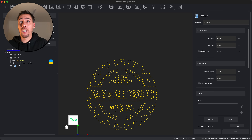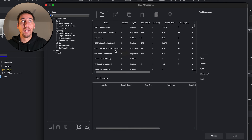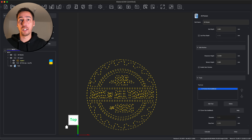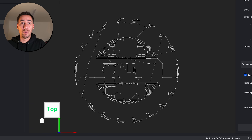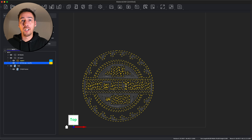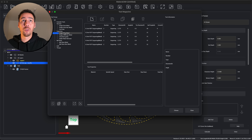We need to set up how we want our pocket cut out, so I'm going for a depth of one millimetre - I think that's deep enough. Then I go down to the tools list, add a tool, and to begin with I want to cut out as much bulk metal as possible, so we're using a single flute metal bit, 2.5 by 12mm. The preset comes with all the settings I need so I don't need to change anything. If I hit calculate you can see it's cutting out a large bulk of material, however hiding the design shows we're not getting great detail - this path is purely to carve out bulk material. So we close this out, highlight the design again, and add another pocket path. For this one we're changing the tool to an engraving single flute 0.2mm bit - it's a finer blade. I'd like to go to 0.1mm but I don't have that tool and need to order one.